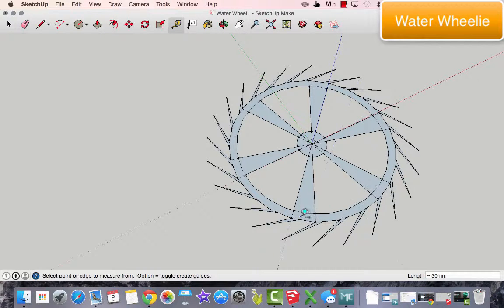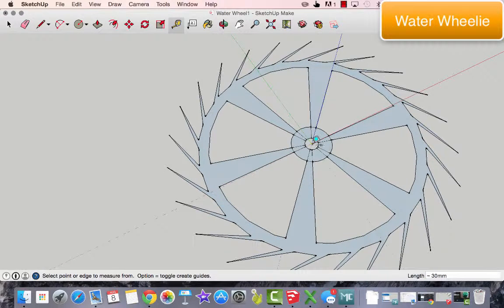Next up, if you can tell here, we've got a lot of pieces, a lot of lines being made here. I want to be able to get rid of those so that way when I extrude it, when I make it bigger and thicker, it has an easier time doing so. So took each of those and deleted out those pieces. So now if I were to pull all of this, it would pull all up as one piece. Next up, cut out the middle piece so that way I can put that push rod through, and got rid of all the stuff inside of here.